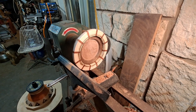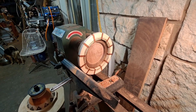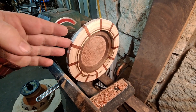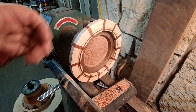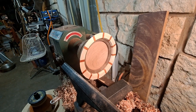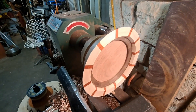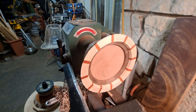I've got the mesquite project I'm working on — it's going to be a smaller bowl. It's been drying for a little while and I'm getting ready to turn it. All I want to do on this one is make it round, maybe take some of these hard edges off until I get it all glued up to see what the wood will allow me to make, since it's from a former project. So I've flattened the face, turned it round, and started to round off some of the hard edges — not taking it to a final shape yet, just taking some of the bulk off. Once I get some other layers on, I'll be able to tell where I can take the shape.